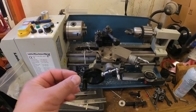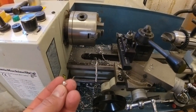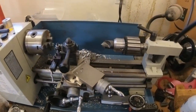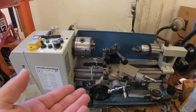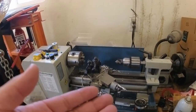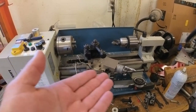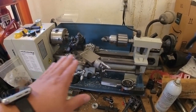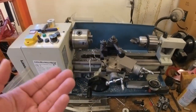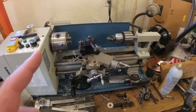Here's an interesting thing to look for that may seem counterintuitive: when I'm looking for a machine, I don't want to see a perfectly clean machine. I want to see stuff in the chip pan — I want to know what's been cut. Look in the corners and underneath in the hard-to-clean areas. You'll find indicators of what this lathe has been used for. If you see chips that look way harder than aluminum — like mild steel or stainless — that's a concern, since these machines don't have the torque for those materials. Don't be afraid to brush the chips out and see what they are.